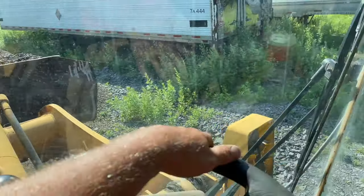And we won't be pulling this wire mesh up. This concrete has fibers in it, the big fibers, full-size fibers. So we're just gonna pull the wire along the footer area, and we have some rebar that we're gonna put in there. It's all pre-bent sitting here. So once we get that filled in, we'll press our rebars in there, and they'll be right where we want them.